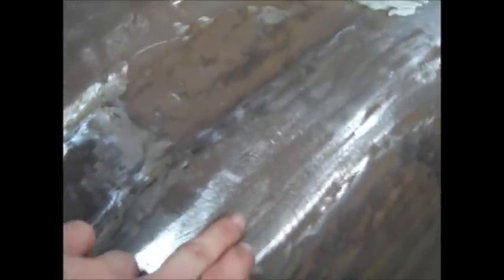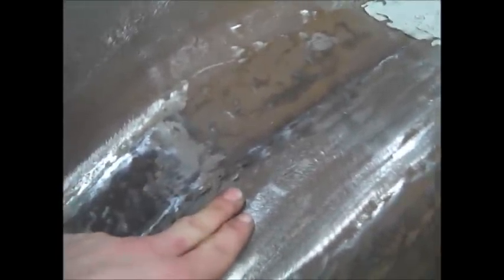And then when you are pounding on this, you want to make sure when you're pounding out little dents like in here, that you don't go too far, just a little bit at a time. Otherwise, if you go too far, you're going to have to pound it back, and you can get what they call oil canning or tin canning, where you can push on it and it pops in and out, and it's really bad. That happens when metal gets stretched too far or stretched too much.